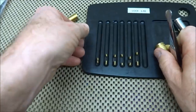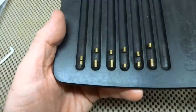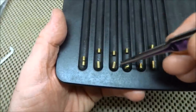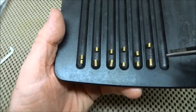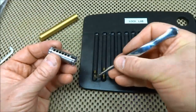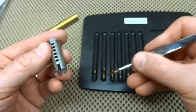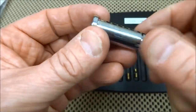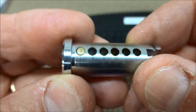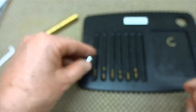These two came out of the same hole — unbelievable. The only thing giving a little challenge here is we have these two very short pins hiding behind these two long ones, and that's really the only challenge in this thing. Out of curiosity, let's put them back in. When this happens you're supposed to use a longer driver — see, that fits up there pretty flush, it's very easy to get both of them. So I didn't overset it at all — I just didn't touch it and it broke the shear line. Should have used a longer driver.